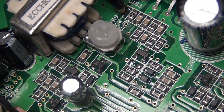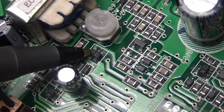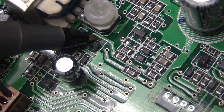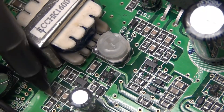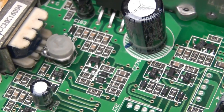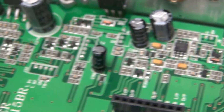That becomes one solder pad right here on this side, and over here this becomes the other solder pad, because that goes up underneath and over to the other one. So we cut in the middle right there — that takes away the signal that tells the audio chip to mute while keyed down, so it doesn't amplify any stray noises.